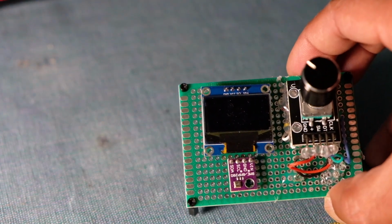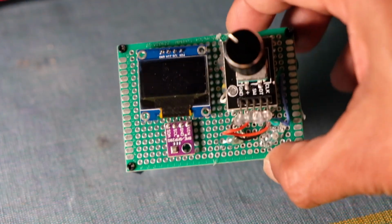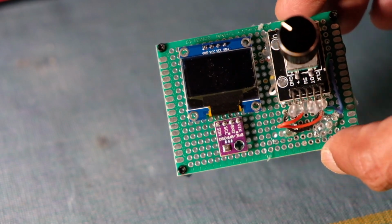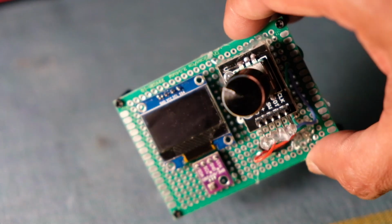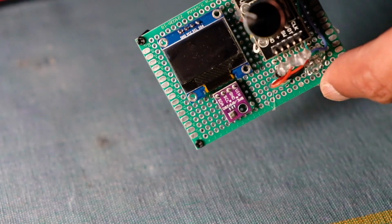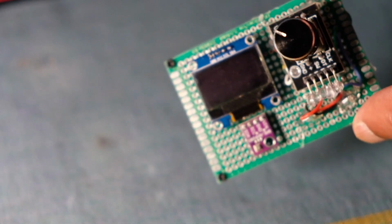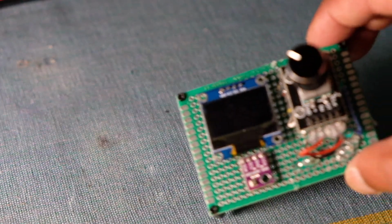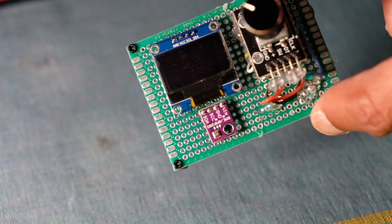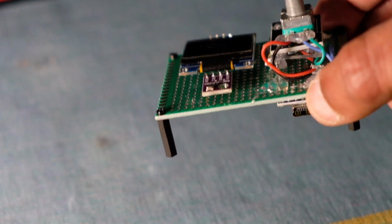It's electronically controlled. I didn't have to write anything because I don't want it to have a fixed value, because that keeps changing. If you have a fixed value, it's pretty much useless as an altimeter, but it's good as a pressure sensor if you're just looking for absolute pressure. And the BME280 is a very accurate pressure sensor from what I can see. It's a MEMS device, I believe.